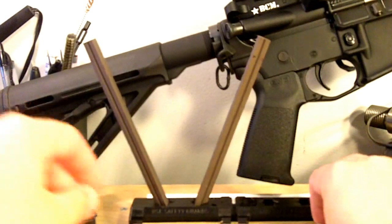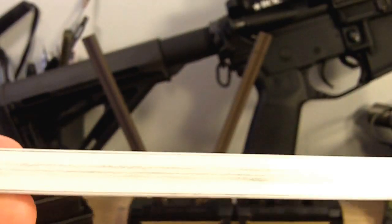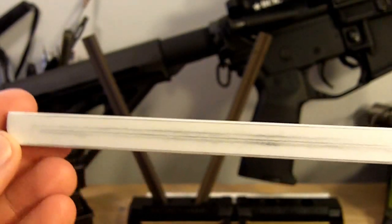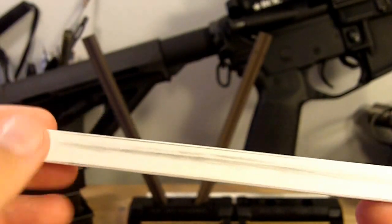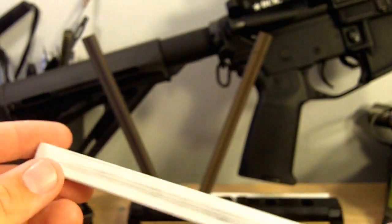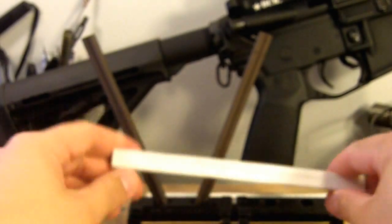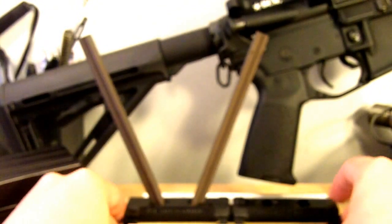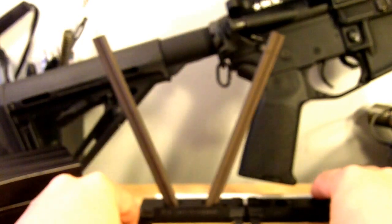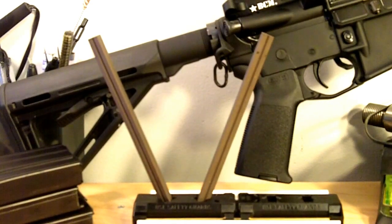And anytime, you can see over time, you'll get a buildup of metal on there, and I can even run my finger on it and get some of that on there. And really, I clean the rods about every 1 or 2 sharpenings personally, because there's no sense in spending more time trying to sharpen on a dirty rod just because you're trying to save time from not cleaning the rod. So those are my few learnings with the system.